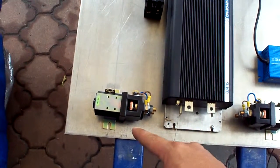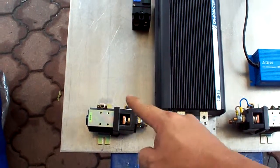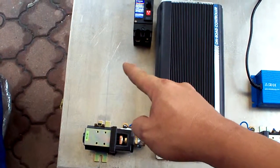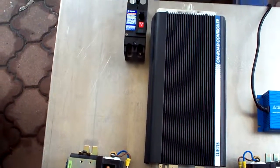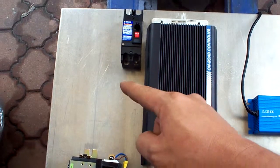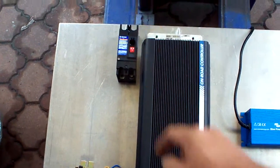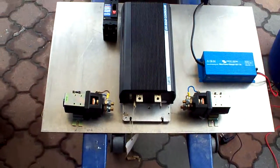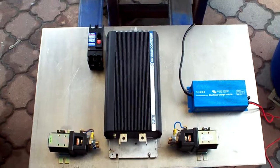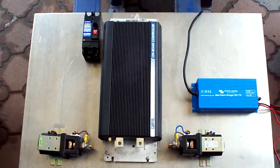So the negative side would be, that's the negative contactor. The shunt would be around here. I've already marked a spot for the shunt, and the shunt goes in here, that goes in there, and that portion will drop down, the continuous will drop down to the motor. So I would tap out all the holes, see how it goes.